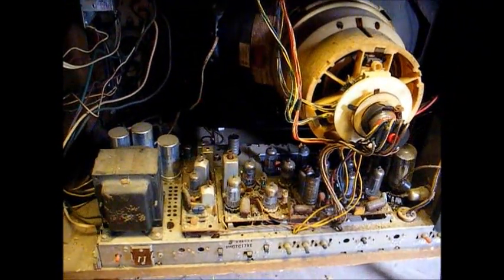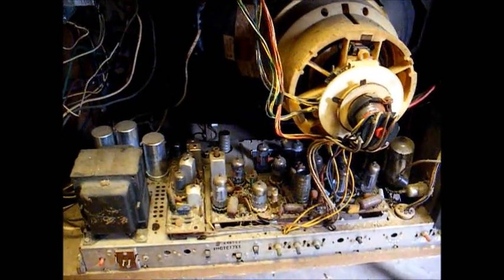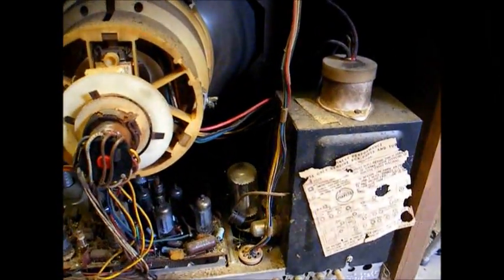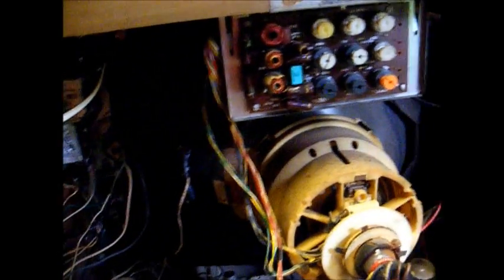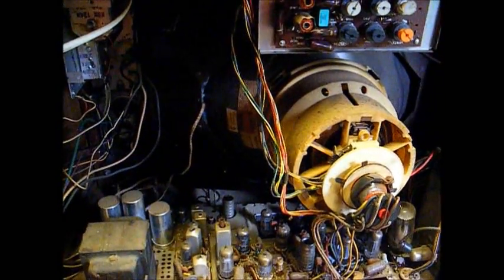Here's the chassis — a CTC17XE, which I believe was RCA's first rectangular screen chassis. I found a warranty card showing the picture tube was replaced with an RCA Colorama in 1969. I could tell that when I bought the set, because there was a little bit of gaposis between the face of the CRT and the mask from where they didn't seat it properly. So I think right now we will test the CRT and see what kind of shape it's in before we continue.